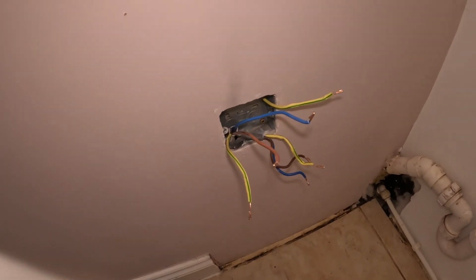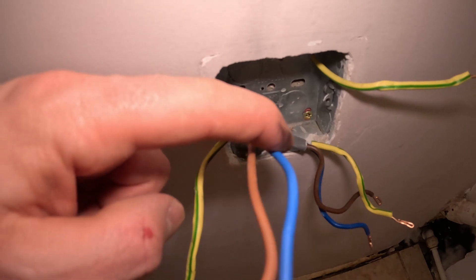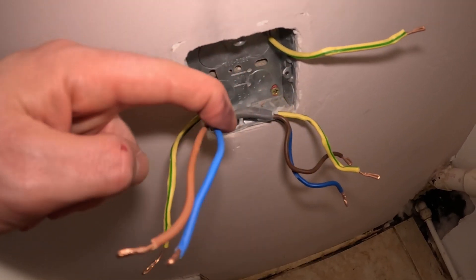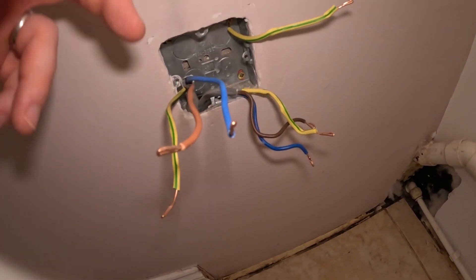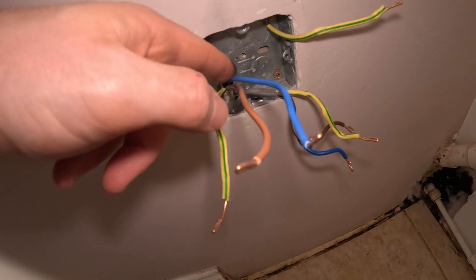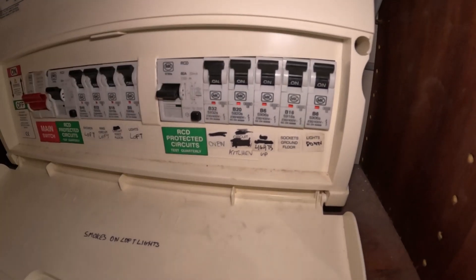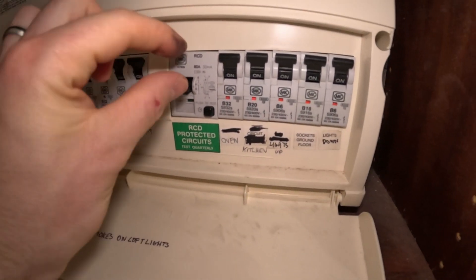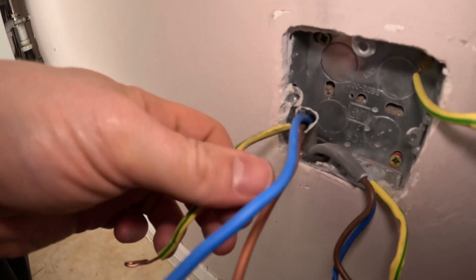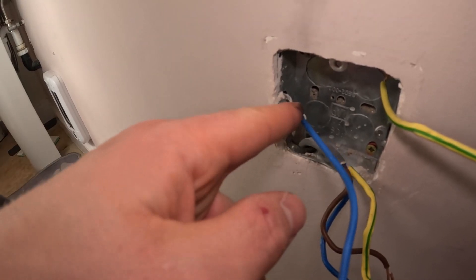So I've taken this single socket off and separated all the cables out. It's this one on the left — you can see my finger — there's all the soot on it. I think this is probably the problem. The reason I split it all up is so that I can put the power on again — and if it blows, I can be certain it is just this cable. Something on here is wrong. Moment of truth. We've immediately gone again. So we can be certain there's definitely something on this cable.